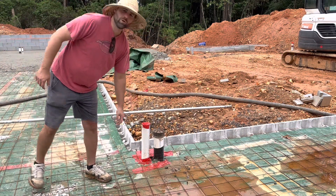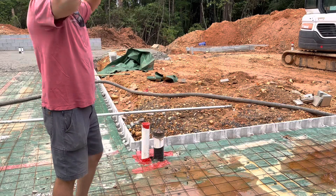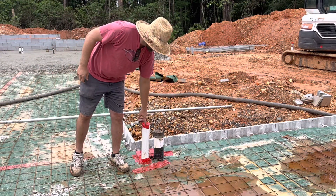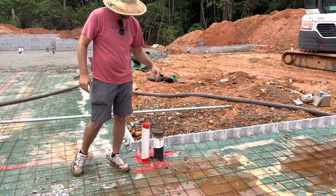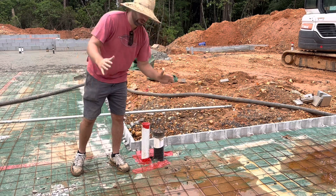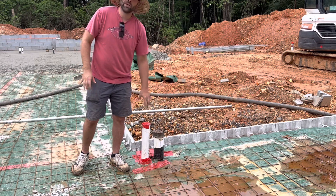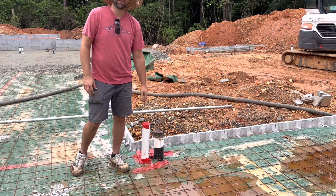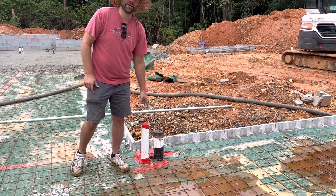This is one of the things we did this morning when we got here, and this has nothing to do with plumbing — it's for future radon mitigation. It's a thousand times easier to cut a 24-inch piece of PVC pipe, dig down a little bit, embed it in the 57 stone, and stub it up through your concrete. We may never use this, but it's there if we ever need it.